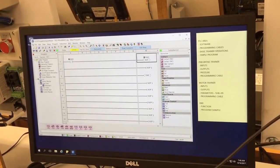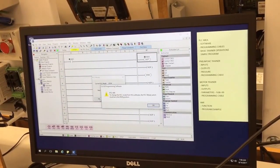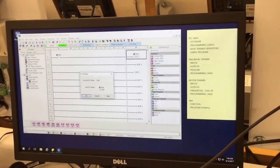At that point I'm going to tell the PLC to go into run, and it says oh, somebody moved the switch — that would be me. Normally we don't want to use this switch; we want to always use the software, or the switch will just wear out.